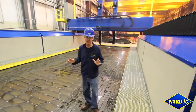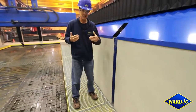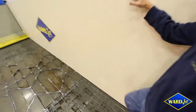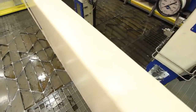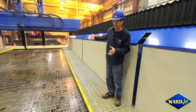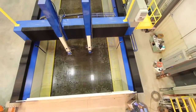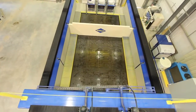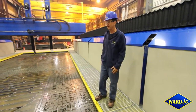Something unique about this machine, and something that Wardjet has a patent pending on, is a wall that we build that fits inside this slot. I could literally be leaning against the wall having a chat while it's cutting less than 12 inches away and know that I'm safe. What this customer wanted was to be able to only be cutting in one part while loading, unloading, and setting up a job in another, without losing dead space that you'd normally need for safety with the five-axis mechanism.